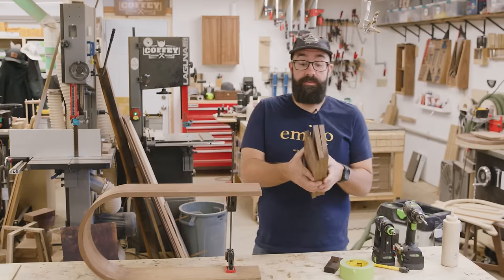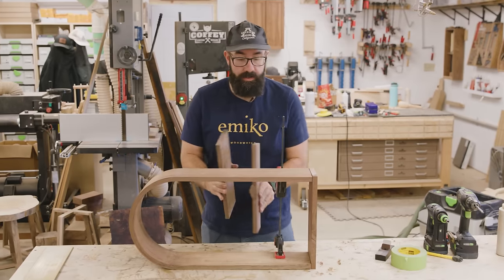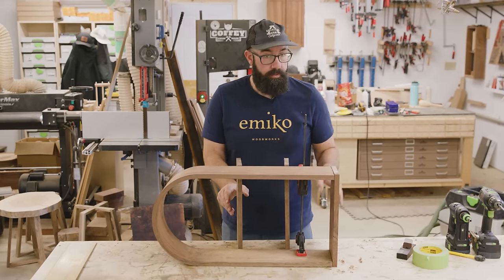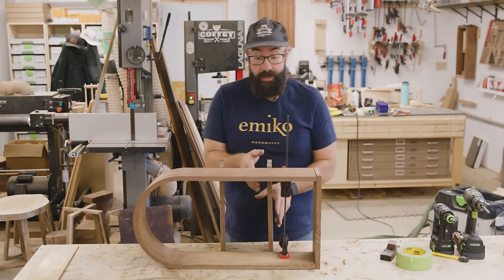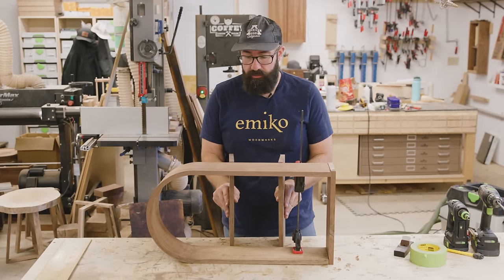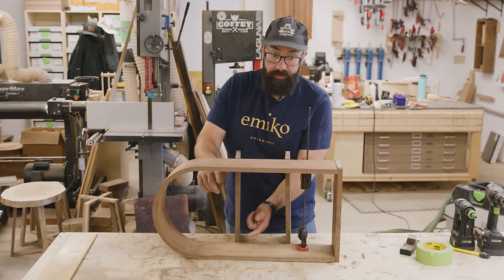I just milled and cut up these three pieces. These are gonna be the bottom, and then there's gonna be a little separator, and then a shelf that's gonna be adjustable in here. The joinery for this is gonna be a box joint, which looks really cool in my opinion, and then a stop mortise and tenon in here, and then this is just gonna be an adjustable shelf. So this will be just a little bit narrower than the width of the cabinet.